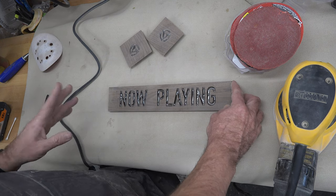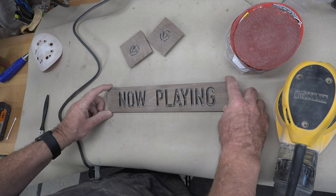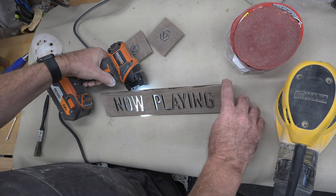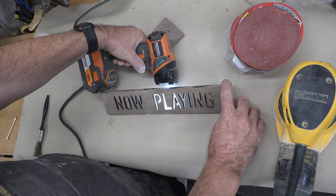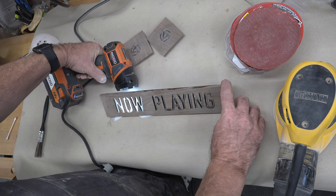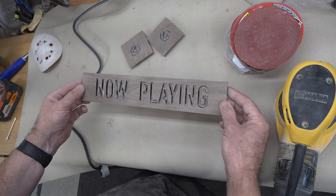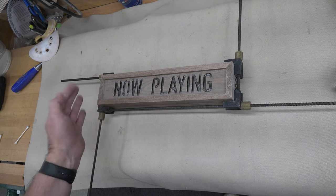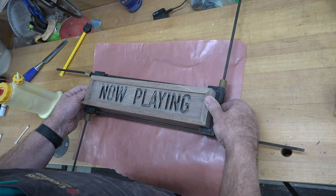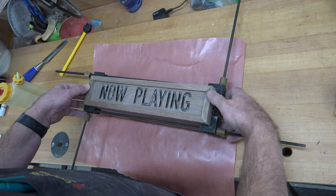Because the resin is unsanded in the front, it's nice and shiny, and it really looks great. I'm going to apply glue to all the miters, clamp this together, and set it aside to dry. From there we can move on to the next step, which is making a base for this. For the base it's nothing more than some off-cuts of the original stock, ripped to a width of 5/8 inch — that will make the stand 5/8 of an inch tall. The corners are mitered so we'll have a raised platform.